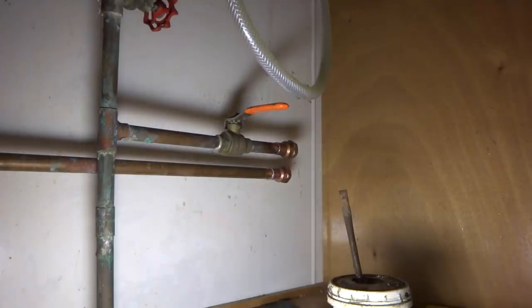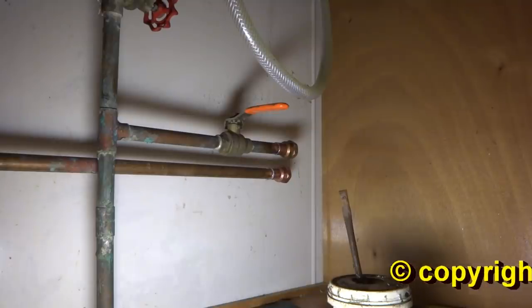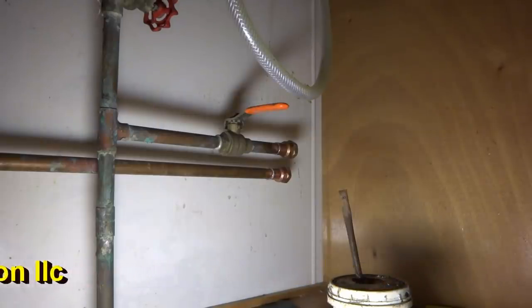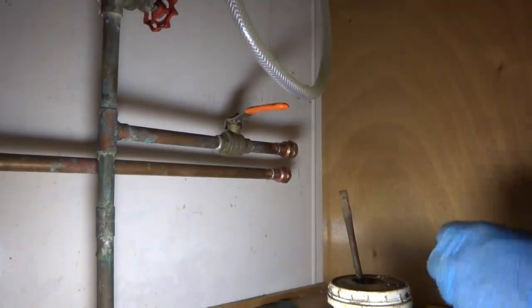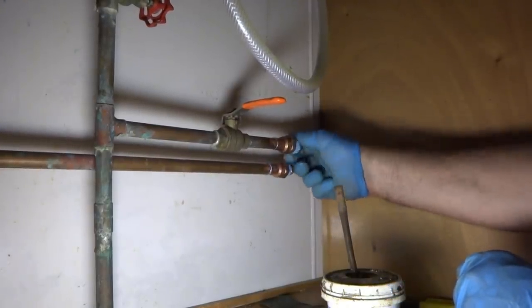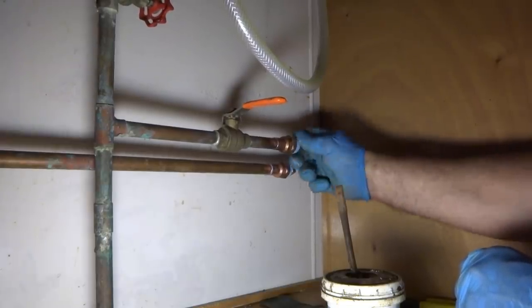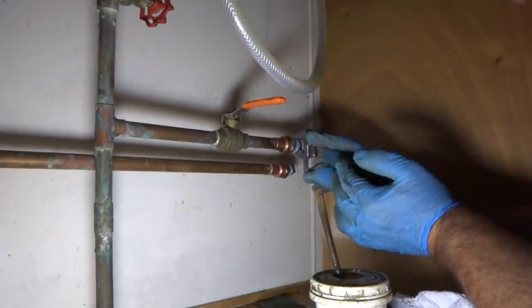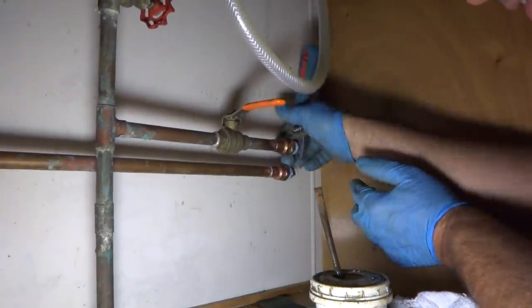So he says we got to go 75 or 100 feet from any septic system. Now they sink a well down near the road. Was it contaminated from the septic? No, not from this one - some other one. He says well water has veins, you know, and this can originate from New Hampshire - it may not have anything to do with any of this. So they've got to do another well, far enough away legally from everybody's septic system. He says I've been doing wells for years - I can look at the landscape and determine about how far we've got to go down. He's guessing about 250 feet.